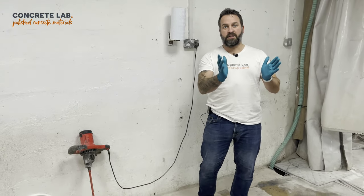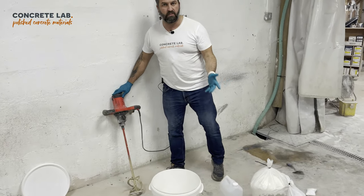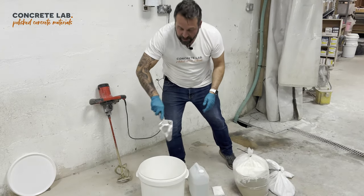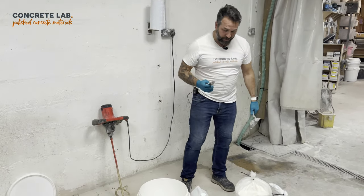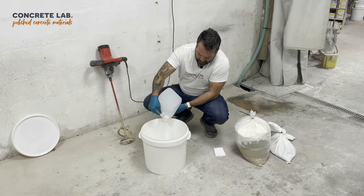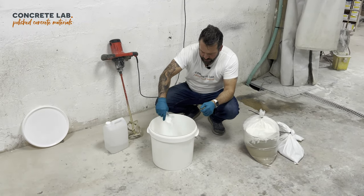We're ready to carry out the mixing process. We have our single paddle mixer — a fairly inexpensive affair you can get from most DIY stores. We've got our water, our additive, the base mix, the aggregates, and the fibres. The other tools we need are a bucket trowel, very useful for scooping out the edges and making sure there's no dry material settling at the bottom, and a craft knife to open up the bag. We start by putting 80 to 90 percent of the water in the bucket and pouring the additive in with that.